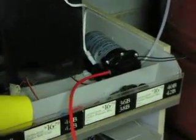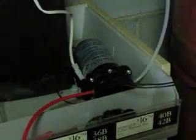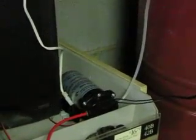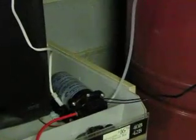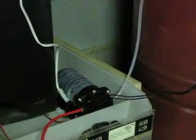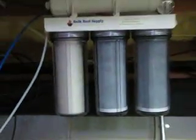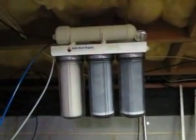It comes out of that red line into the actual booster pump. It's not running right now because I have a pressure switch — I can just flip a switch upstairs to cut it off. That's the actual booster pump. The red line coming in is the inlet. I ran out of red line so I used quarter-inch water line from Lowe's or Home Depot. It comes out of the booster pump and up into the unit I got from Bulk Reef Supply.